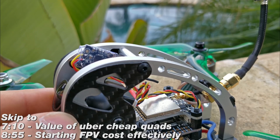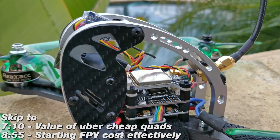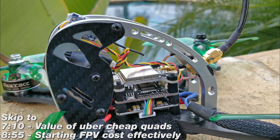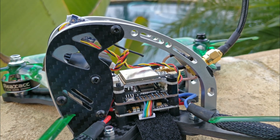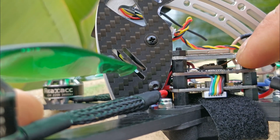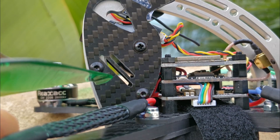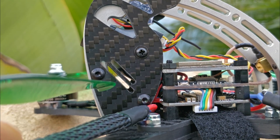When I took a look at it, I thought it actually seems like it might be reasonable. Starting with electronics: the VTX seems like a straightforward VTX — nothing special, but who needs a special VTX? The flight controller — I knew it was a Revo board. It's not an omnibus board like it says in the description, and it does not have an OSD, which is pretty ridiculous by today's standards. But it's $139, so whatever. The flight controller is actually kind of nice — it has the IMU on a wire on a foam pad on top of the processor, so there's your soft mounting right there. The ESC board looks just like any other typical low-grade ESC board, so it should probably perform adequately.